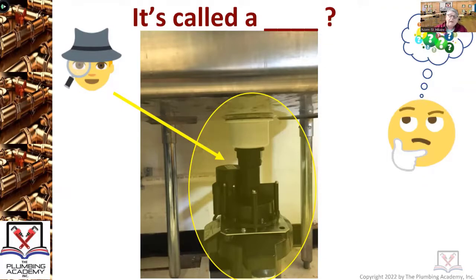Because when you have a tank, that means it has a chamber vent, has to be vented to the venting system. The fixture itself has to be vented. All it is a sump with a pump in it, and it's typically 5 gallons. There's a big difference between a single fixture pump and a sump with a pump that's 5 gallons, because they both have completely different definitions.